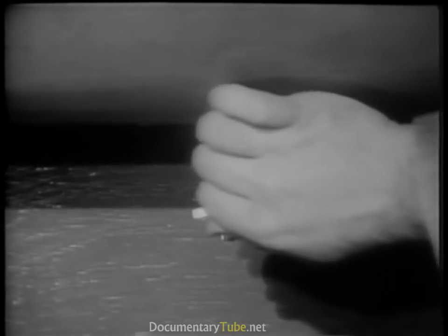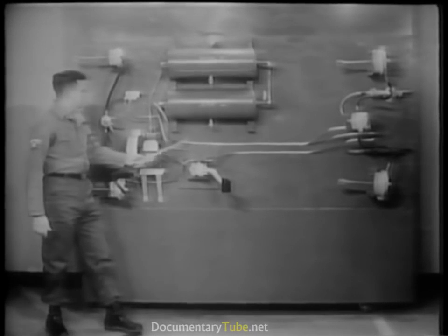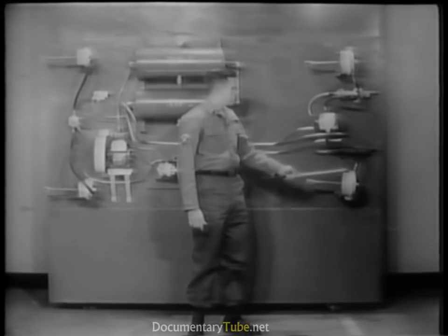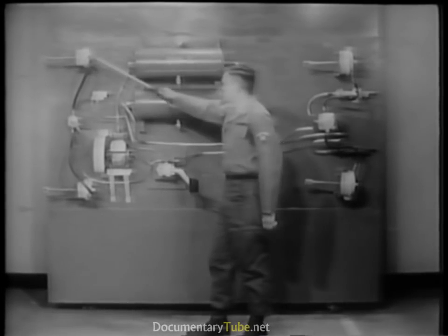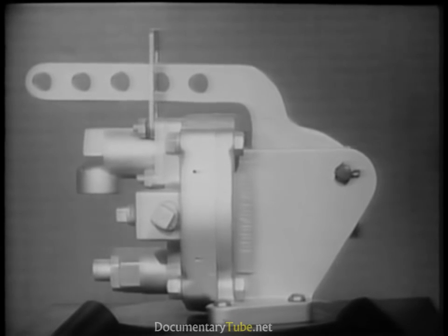Normally, the reservoirs are drained every day. The compressed air feeds from the dry reservoir through two lines: one that leads to the air brake valve, and one that leads to the relay valve. Both valves control the flow of air to the brake chambers located at each wheel. The air brake valve is connected to the brake pedal. The air brake valve — the heart of the air brake system — meters the required air pressure equally to all brake lines and chambers. This is a plastic mock-up of the air brake valve, sometimes called the brake-apply valve.